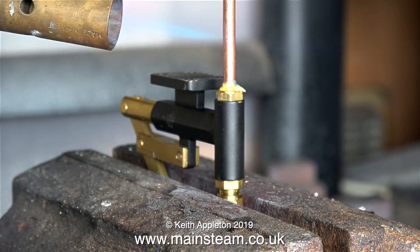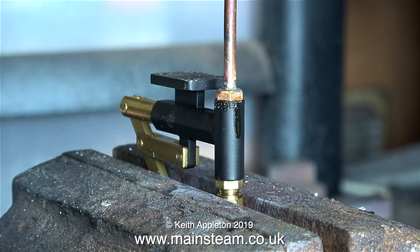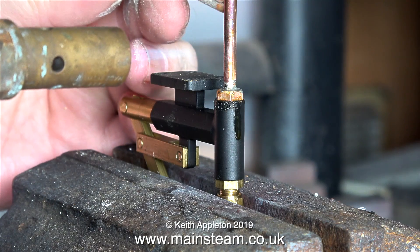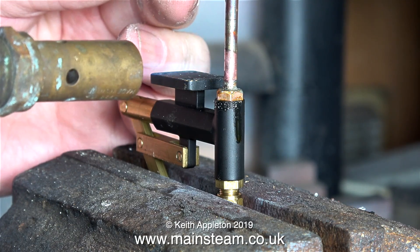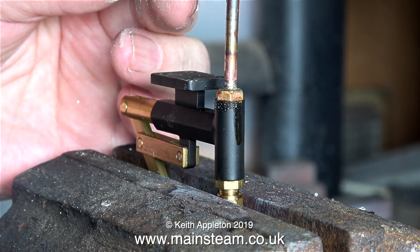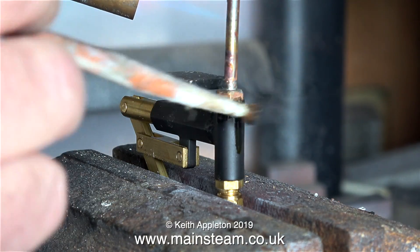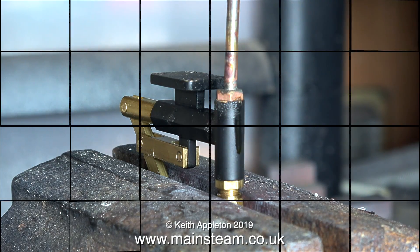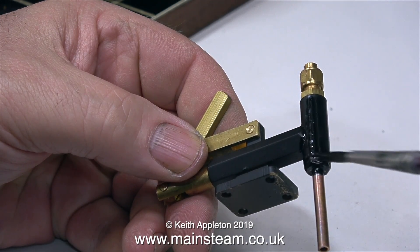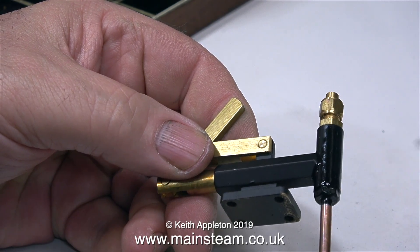Over now to the outside part of the workshop. I'm using a very small nozzle on my blowtorch because I need to soft solder this piece of copper pipe into the bottom of the pump's inlet — I don't need much heat, just sufficient to melt the solder. Whenever I soft solder I finish the job off with a paintbrush dipped in water to clean away the flux residue. The paint on these hand pumps chips as soon as you look at it, so in this clip I'm repainting the part that got damaged by the heat.